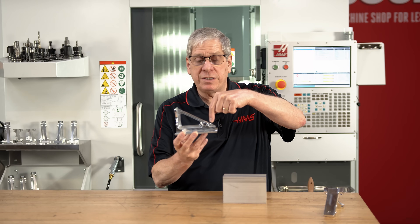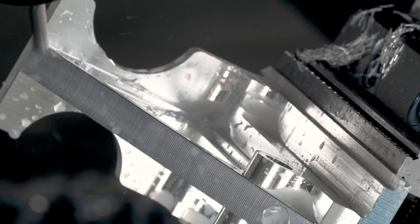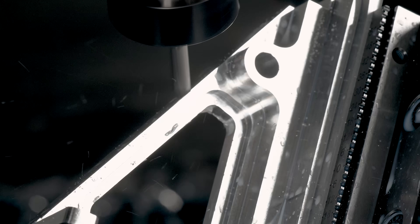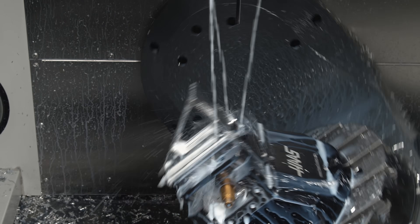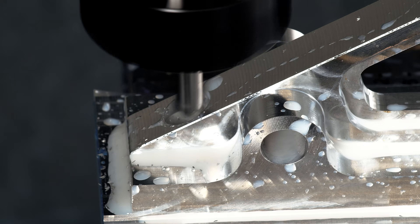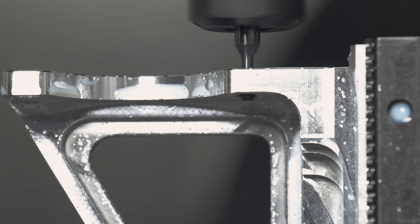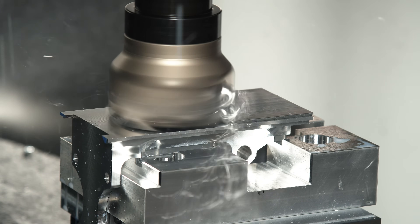We flip it over and finish this end of the part, then drill the pivot hole through the boss and rough and finish the center rib with a smaller tool. The next operation helixes the counterbore in the rib and with the same tool we deburr sharp edges that we can't normally reach with the 45-degree chamfer tool. This is one of the benefits of five-axis machining — you can orient the part to the cutting tool to take advantage of cutter geometry and do some really unique things. The next operation drills a hole through the counterbore, then rotates the part up to drill the four mounting holes in the small flange. Machining the sixth side is simple — facing off the leftover stock and chamfering all the edges.